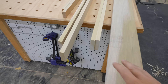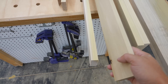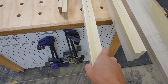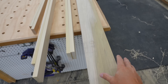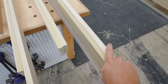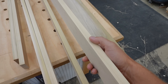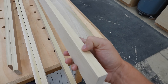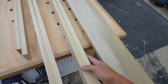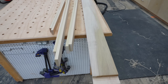At this point we are ready to cut these to length. The pieces we ran through the planer on one side and jointer on the other have both edges glassy smooth and the width is absolutely perfect. Some pieces have one table saw edge, but it'll face down towards the floor — not a big deal. The vertical stiles will have a cut edge towards the wall where it won't be seen, so I strategically mill pieces according to what I need from each piece.